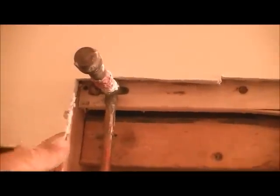I bumped up the shower head a little bit — it used to be down here on a two-by-four which is a little bit low, mainly because this floor has come up. So I bumped that up and it's a pretty good height right now. Getting back to the floor area, I'm getting ready to put my pan liner in — pan liner is a PVC material that comes in gray and red and different colors.